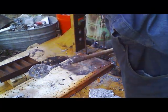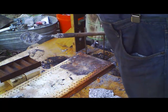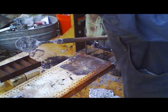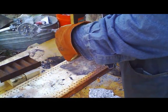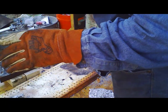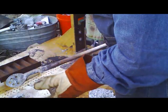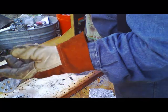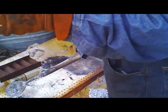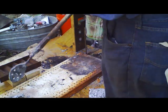You've got plastic coatings, paint coatings, all kinds of junk incorporated in a soda can. If you take a Coke can and put it on a shelf, six months later that Coke can will be empty because the Coke ate through the aluminum — it's that thin. So try and find lawnmower decks, blown-up lawnmower engines, cylinder heads, engine blocks — anything that is pure or better quality aluminum. Break it up, cut it up with a reciprocal saw, and mix it in with your soda cans. As a matter of fact, I've got to skim out some slag now.